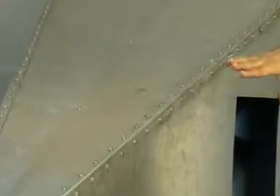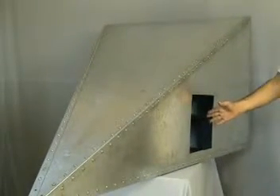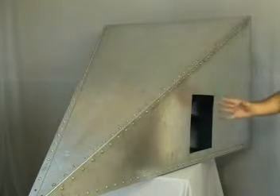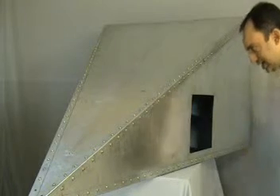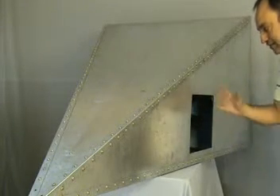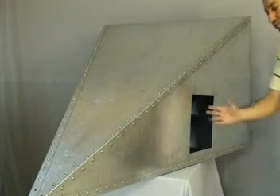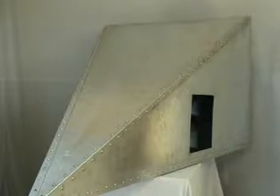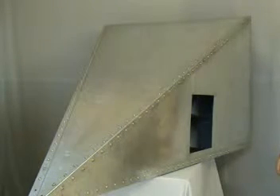The cell has a tapered septum which is terminated into the back wall, and from the side we can see that there are absorbers inside. The object under test can be placed inside, and it will simulate near open area test site conditions in a volume of roughly 1 foot by 2 feet. Small mobile phones, pagers, or antennas can be used for testing.